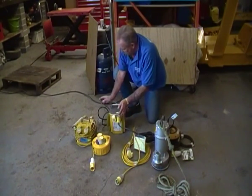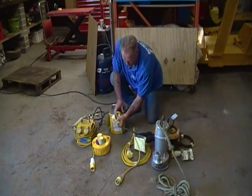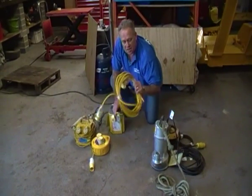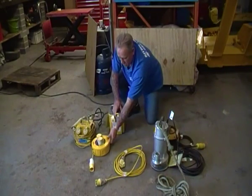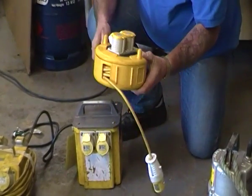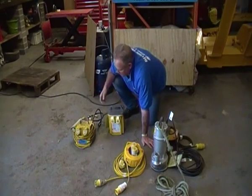There's not a very long lead on transformers — that's not normally the case because transformers are normally kept inside. So you'd get that as close to an electric socket as you could. Then of course your foundation trench, your pond, or whatever it is you're pumping might be quite a long way from the socket and the transformer, so you would use an extension lead. But this is a 110 volt extension lead. You can see the cables are a lot more robust, a lot thicker than some normal 240 volt cables. This is a typical example of a 110 extension lead that a home improver would hire — it's a little bit thinner, not quite so robust, and it's on a drum so it can be wound in. This would go into the transformer and there are your two outlets there.